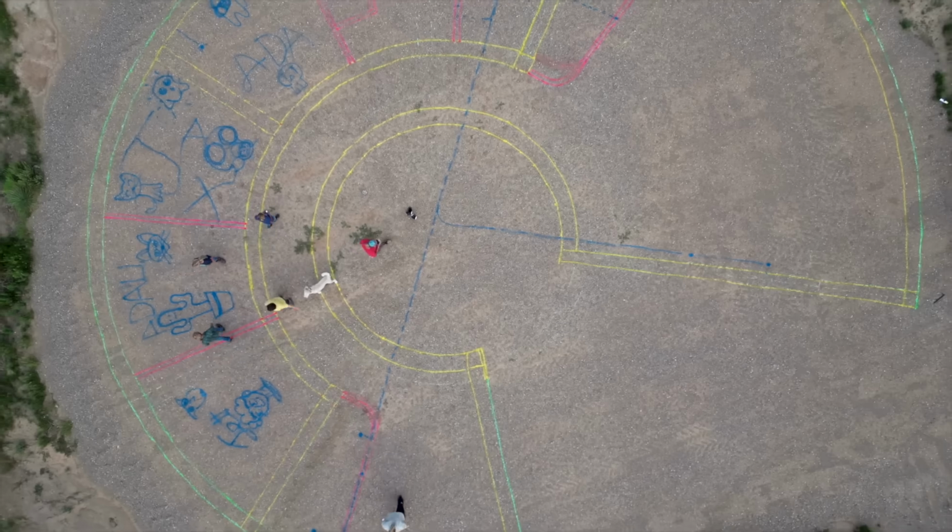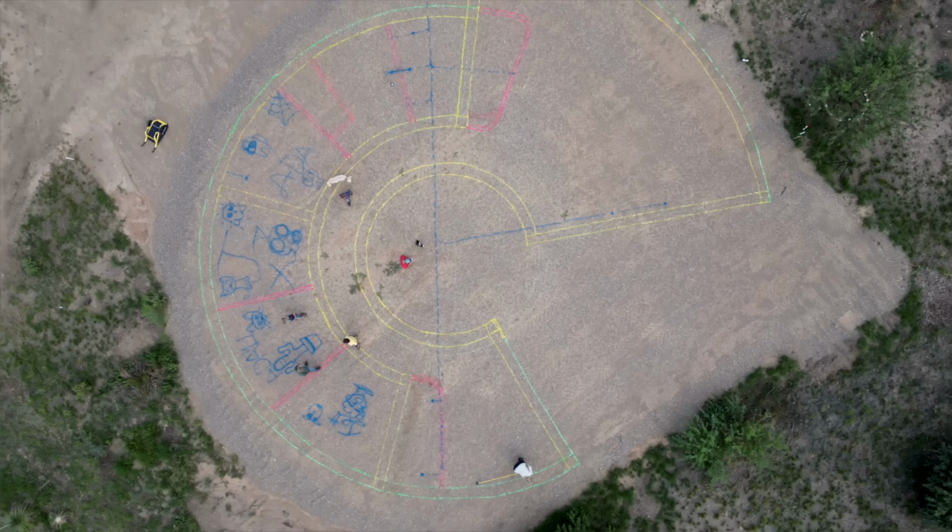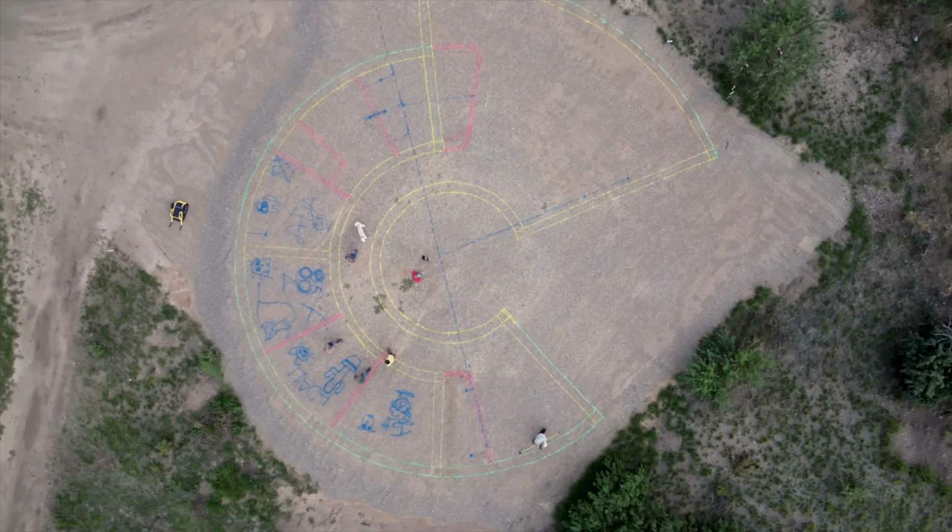So the hard part we've got to figure out is where the sink line connects to the main line in the middle. We need to get that at the proper angle. We had it at like a 90 plus, and that's not going to work, so we're going to use 2 45s, but we got to get that to match up just right. So that just means that the line under the kitchen sink needs to not be perpendicular to the wall. But I'm not sure how to figure that out.